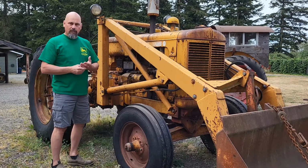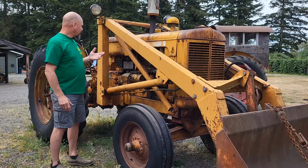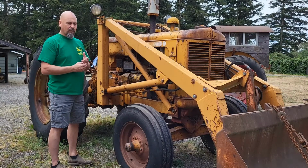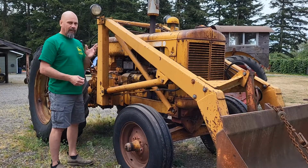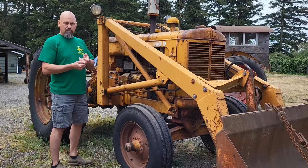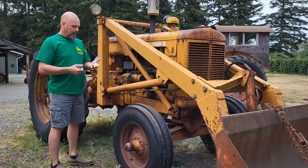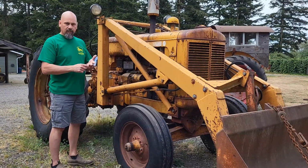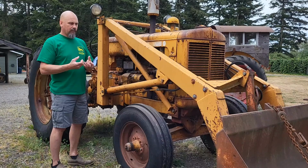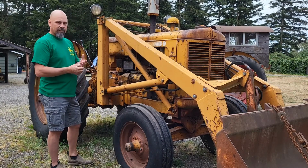So first thing I'm gonna do is take off my wedding ring. I'm gonna put this in my pocket right here for safekeeping. I'm doing that because I'm working with electrical. No, I don't have the rubber bands. I just got this tungsten ring. I have had experience with grounding my finger: the ring touched the body of a vehicle, and the wrench I was trying to protect from touching the body, when I was helping a buddy of mine work on his car at work to get it started. It melted to my skin almost all the way around. I was able to fling the ring off. It went flying. It was a gold ring at the time, and it popped loose at the connection point where it was soldered together. So I like to take my ring off.